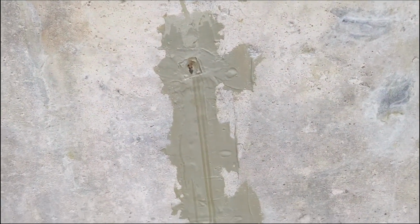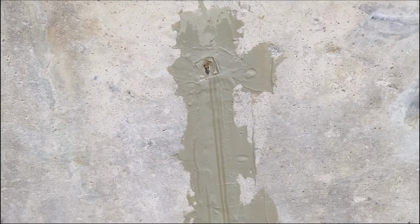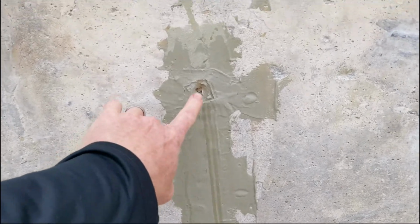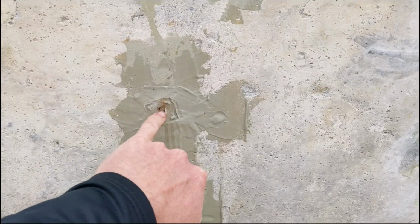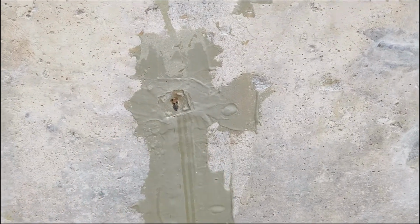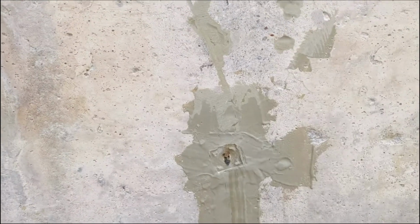So it's a 2-part epoxy kit. I got this from, I'll put the link in the description if you're curious. It's like Rhino epoxy. It's meant for pools and other cracks too, like for garage floors. So you start with these little squares where plastic injector ports were, and you're going to epoxy those on with an anchoring epoxy and leave a hole. And they have little ports at the end that you can put a unique caulk gun in, and then you put those every 1 foot on the wall.